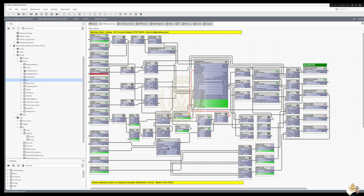But if we do lower the set point down, then eventually the set point 60 minus 40, so that's going to be 20. So that needs to be 20 before we go down to 2 pumps. But because of the height of the building, I know it's only like 3 floors, ground and 3 floors, and the heat pumps are up on the roof, we really need those heat pumps with the right flow to them, otherwise they'll go into fault. So we would never ever go down to 2 pumps. That's impossible. It would never happen, really.